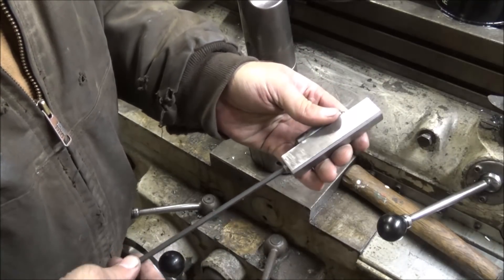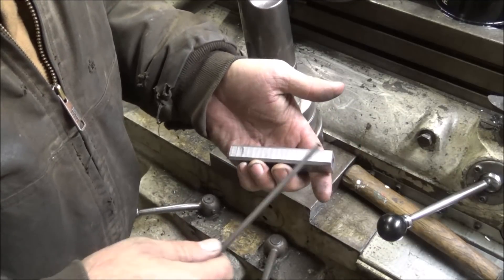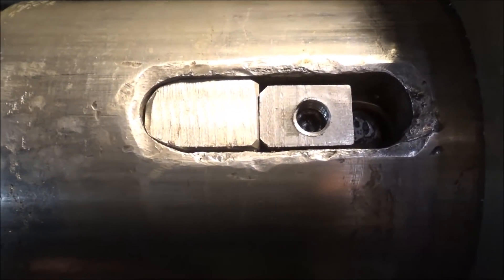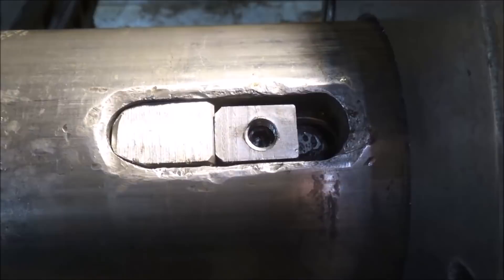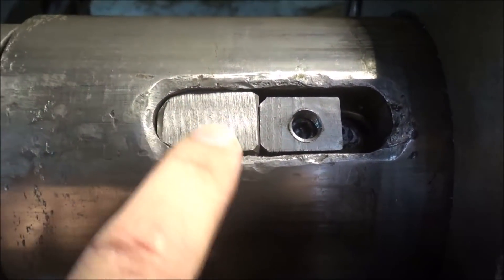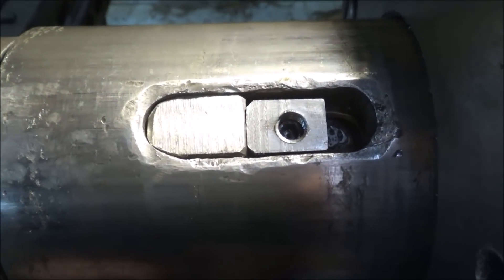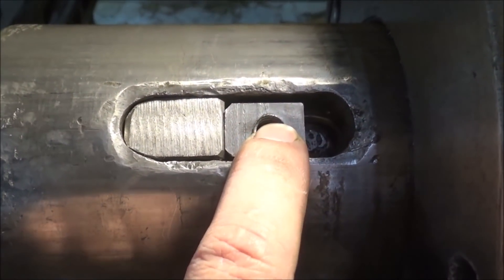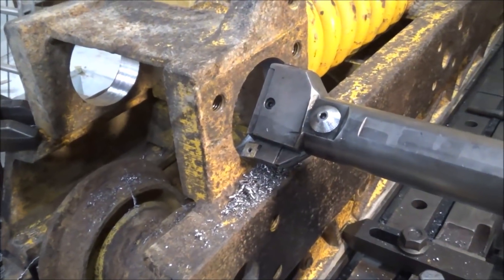Back together it goes. Now you'll see what I rigged up in the middle to make the rest of this work. There's the wedge in my spindle — you can see the piece comes out and pushes against the Morse taper inside and draws it in and locks it. I cut these blocks and ground them to fit side to side, then ground the radius on the end to match this half-butchered hole from where the spindle's been cut back over the years. The wedge is in there, good and tight, holding well — I'm not getting any chatter out of it.